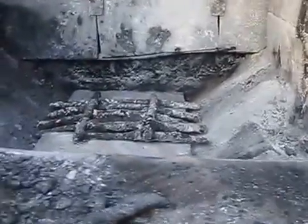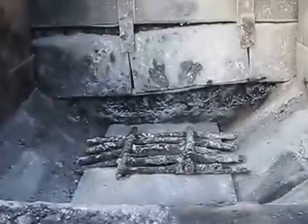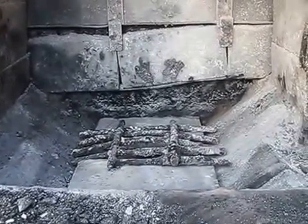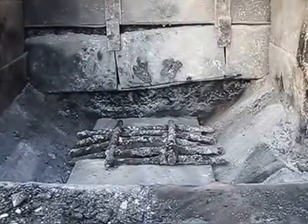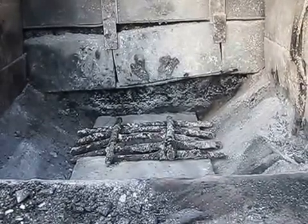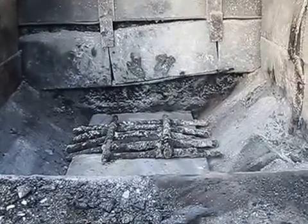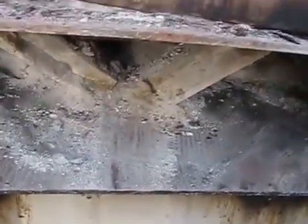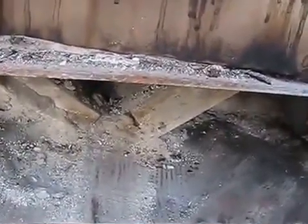Hopefully that gives a little more understanding of what I'm doing here. It's been working pretty good with all that insulated fire brick — the secondary burn gets going pretty quick. I do have to clean this out about once a week. I usually let it burn down more so I don't have as many hot coals to deal with, but it's actually pretty easy. I just pull out any coals, set them aside, pull all the bricks out, everything falls down, and I scrape it out the front door into a bucket.